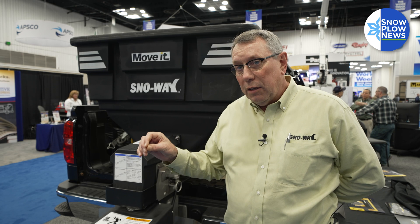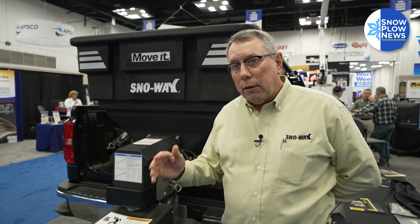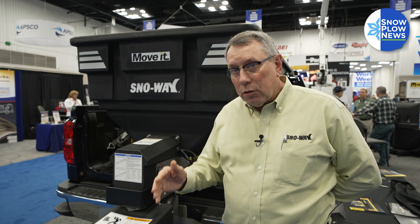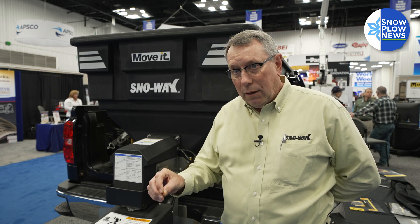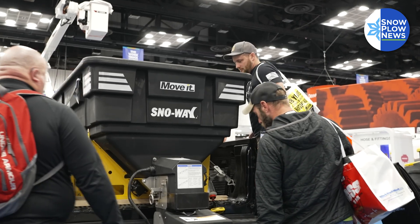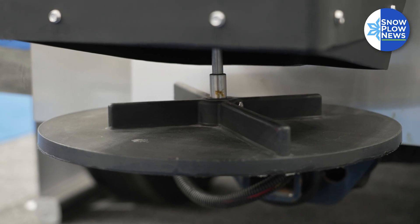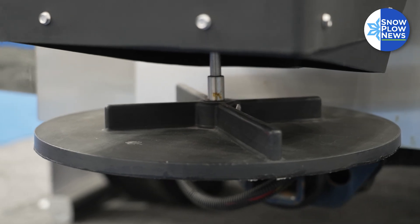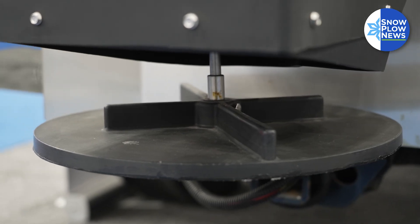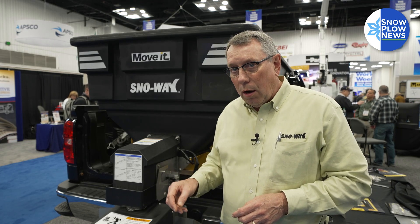The difference between the auger and the pintle chain is that with the auger, you have much better control of the amount of salt you want to output. With a pintle chain, you're talking a 14-inch wide by 6-inch chute, and the salt lays in there, hits the spinner, and drops — plump, plump, plump. So if you're trying to flow a certain amount of salt to cover the area properly, it's not as predictable with a pintle chain as it is with an auger.